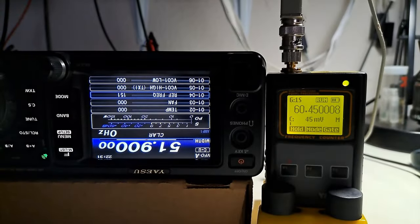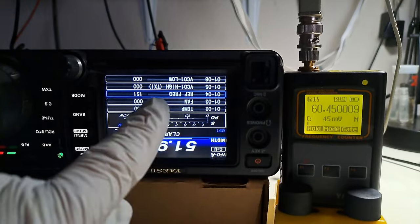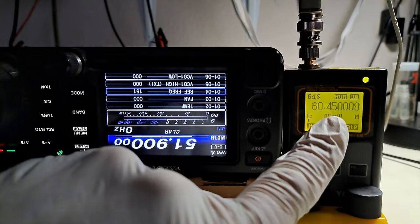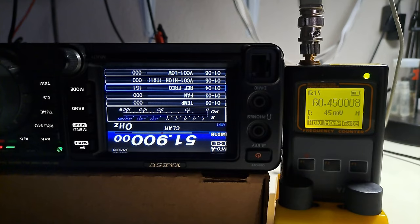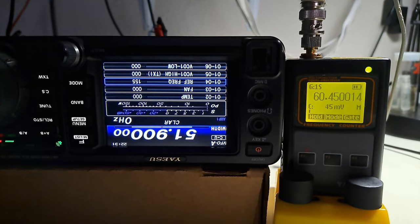Now everything is ready to tune. I'm using another probe which has less input capacitance, and the frequency reading slightly increased — so it looks like the circuit is sensitive to input parameters. The transceiver is in service mode, field 0104 is active and ready to readjust. Counter is connected and working. I'm slowly turning the knob and the frequency increased, so this is the right direction.